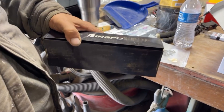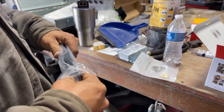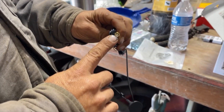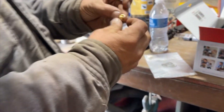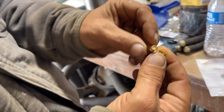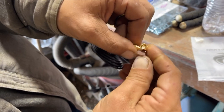We weren't sure how that was going to work so I decided to get these accessory Bingfu Wi-Fi extending antennas. A word of caution: first, they did not increase the decibels of the Wi-Fi better than the ones that came with the Foscam cameras, and second, there's a minor difference in all of these connectors. There's no male pin in there and the Foscam camera looks identical — it's also a female coax. So I had to go find adapters that had a male pin sticking out in the center of the coax on both sides. Even after going through all that trouble, the decibels of Wi-Fi at the front gate were not improved with these generic antennas.